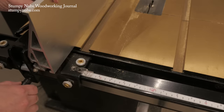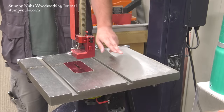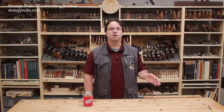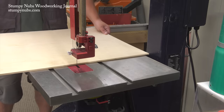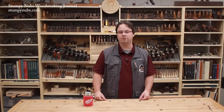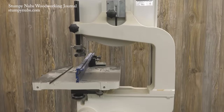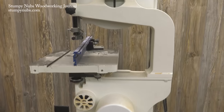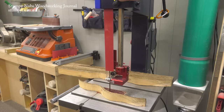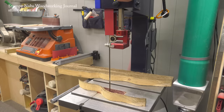For example, throat depth can be a very limiting factor. Manufacturers label their saws according to the distance between the blade and the column. A 10-inch saw may sound plenty large, but when you're trying to swing a large workpiece to cut a curve or cross cut a board, the larger the capacity the better. 14 inches is the standard for small woodworking shops. And don't confuse throat depth with re-saw capacity — most 14-inch bandsaws will only cut about 6 inches of material. If you want to re-saw lumber, you have to look for a saw with about 12 inches of capacity in the vertical direction.